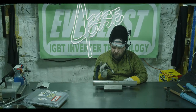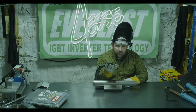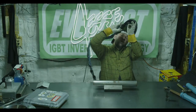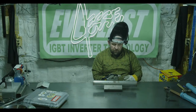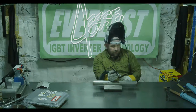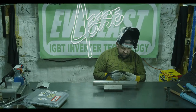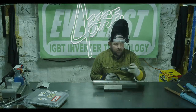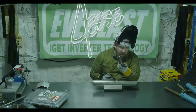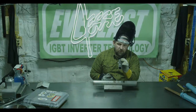I'll run through a couple settings like pulse — how to set up a pulse on the trigger, which is what I was using this weekend doing a roll cage. When you're tucked up upside down in the back of a car or in the trunk doing a roll cage, having the finger switch is really really helpful. I've got some scrap tube here, barely very poorly fit up — this is 0.083 inch-and-a-half chromoly.